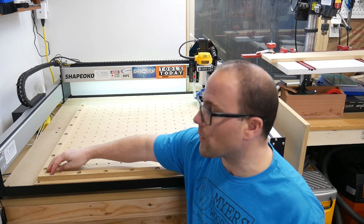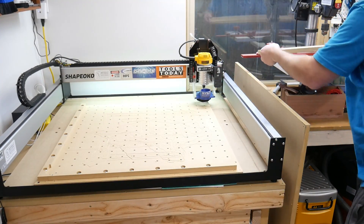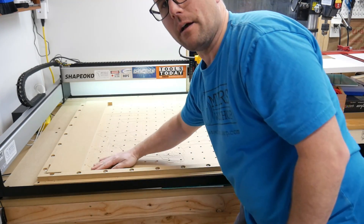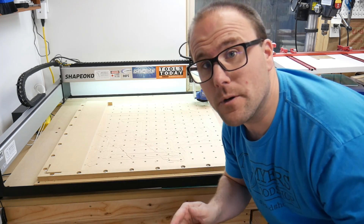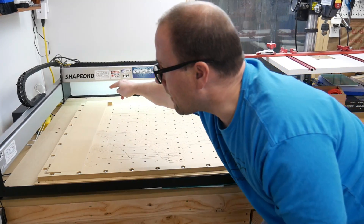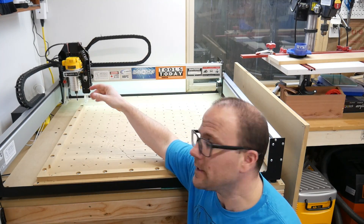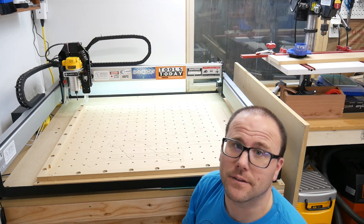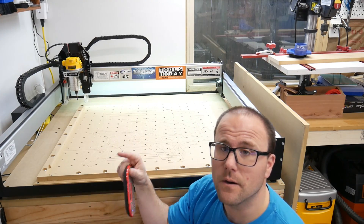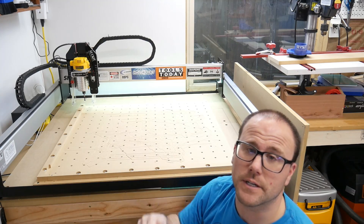So now we have our fence installed — we have the single one along the front and then the L over here with the probe indentation, and the line up there. Now we know our X and Y will always be over here in the corner. It's very simple: when we want to put something down, we set it down and put it over in the fence. Those cam clamps I made will easily push against one side and we're perfectly straight to the fence. But there is one more step if you want to go even further into perfection — we're going to take the bit and run the router straight down the inside so that the L is perpendicular and parallel to our actual router bit. You do lose out on some cutting area because the fence is offsetting in, but it's not that much.